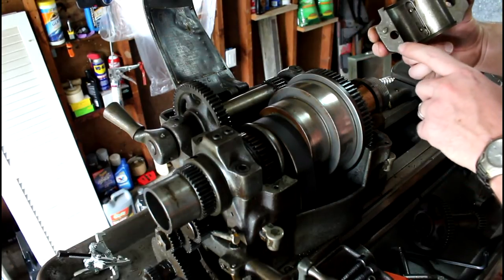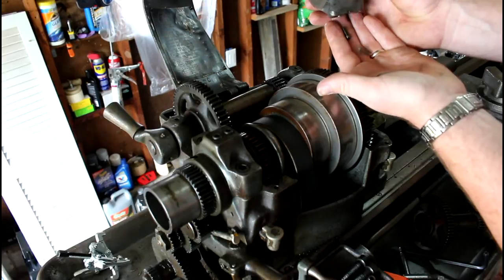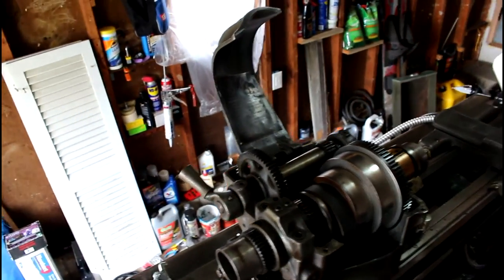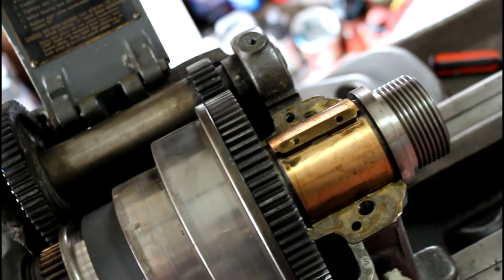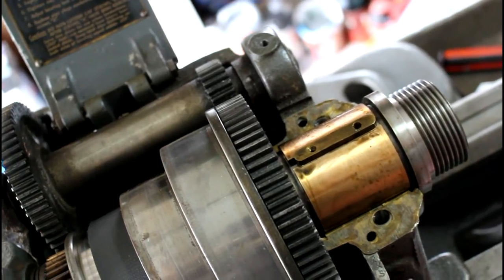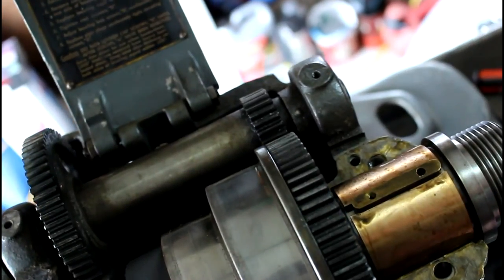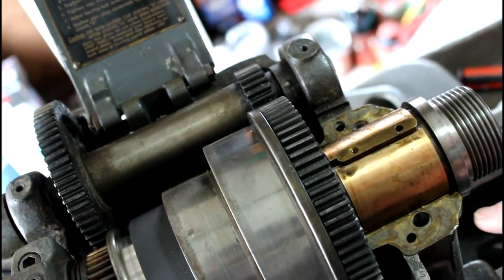You want to take your time with these. You don't want to pry on these, and be careful when you take them out because there's shims under there. You don't want to pry in here because these are all scraped and they're fit for this machine. So make sure you don't lose your screws. That cap only goes back on there one way. If you can see right here — here's that brass dovetailed, or bronze, whatever it is — dovetailed part that fits into your cap there, and the screws go through there. So you need to undo this. You can't just pull this off, otherwise it has a possibility to wreck it. And then be sure you've got shims here, so make sure your shims stay in place and put the same ones on each side.